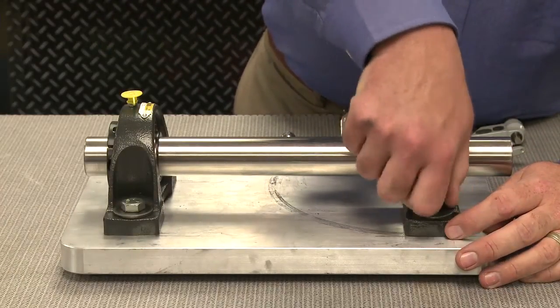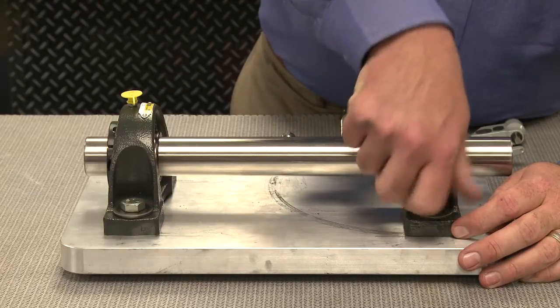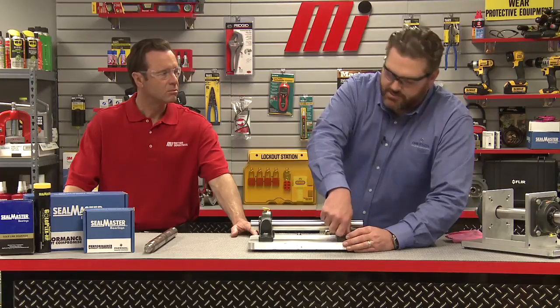For some bearings and framework, like what is shown here, there are fixed mounting hole locations and minimal play between the bolt hole and the housing. In this case, the bolts can be tightened all the way. Housing bolts come in various grades and sizes and are typically not provided with the bearing. Proper bolt torque may be found in the equipment manufacturer maintenance manuals or a general fastener handbook.